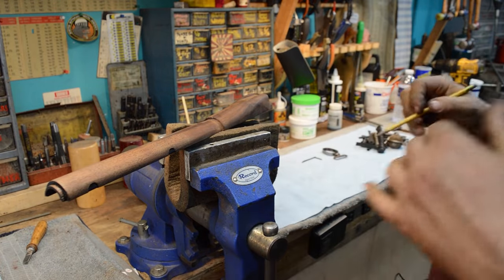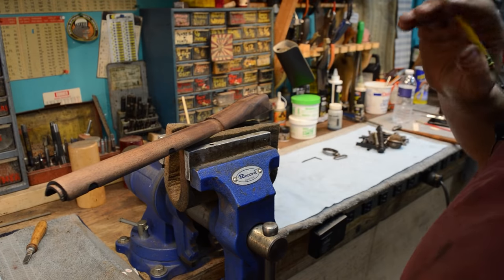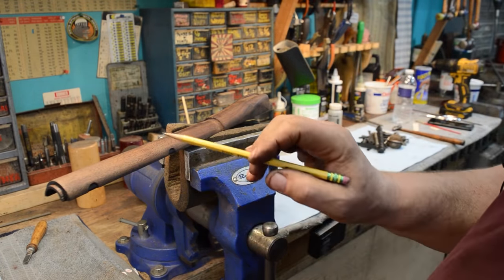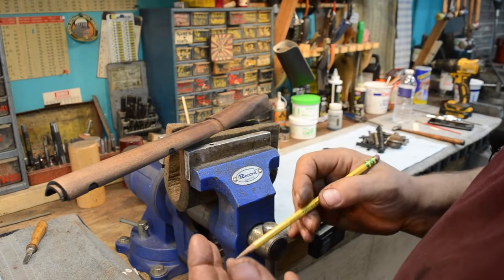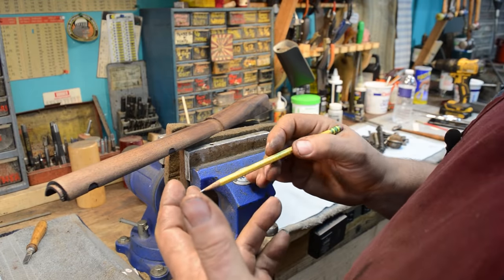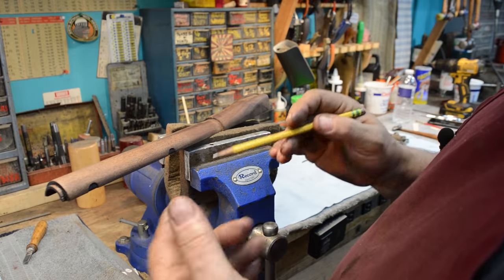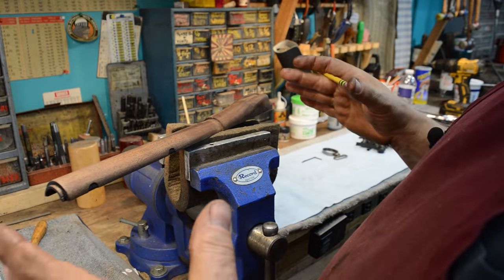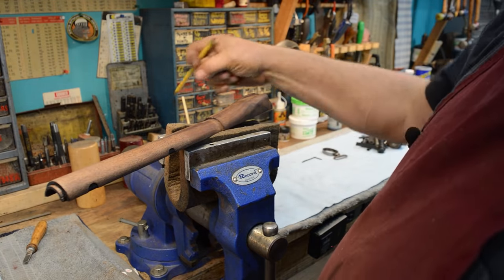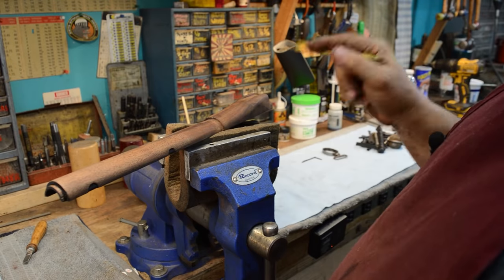And I'm just telling you, this is a Sarco. I think this is military new old stock. I have no way to prove it. But what I'll tell you is, these guns did not come with 320 grit sanded finishes. They did not come with 8 coats of French polished oil on them. From my research, they were sanded out about this way, dipped in a freaking bucket of boiled linseed oil, left to drip dry, put in a box and mailed.